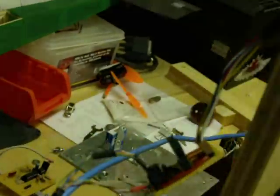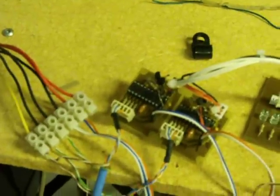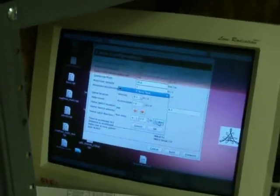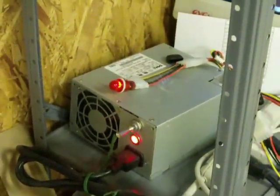Just using my regular power driver that I have, I'm using a couple of PICs to convert the step and direction into the pulsed steps. I'm doing full stepping, and there's my little breakout board, my computer, and EMC running the system, and an extra power supply giving me the 12 volts to run this.